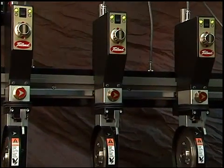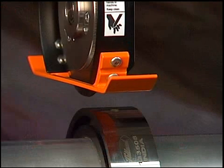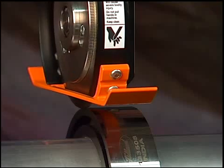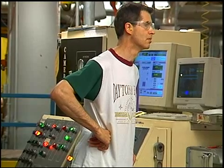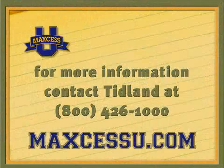Use of the E-Knife Holder turns the art of slitting into a science. Auto-calibration of side load force and overlap directly improves the predictability of the other slitting factors. This predictability eliminates the guesswork in maintaining consistency. Blade sharpness is the only factor that needs to be monitored. For more information about auto-calibration on the E-Knife Holder, contact TIDLAND at 1-800-426-1000.